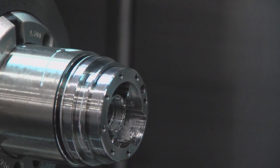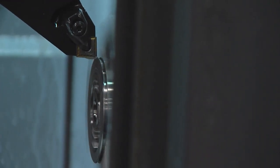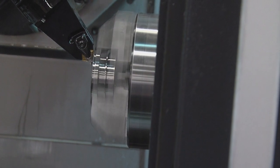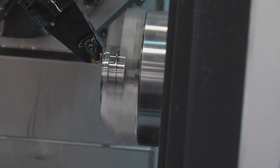We're going to grab another turning tool and go over to this head. This particular surface being machined is a datum surface, so it has to be parallel with the other surfaces. The tolerance is a thousandth of an inch, but really you have to hold it in about five tenths or the other related features become hard to hold. We take several passes — the majority of material in the first pass, then a light pass, then a final pass of only about a thou and a half to take a fine cut and machine it parallel to the next surface.